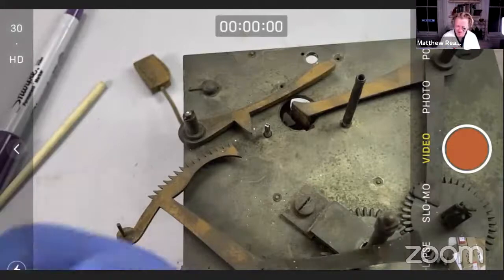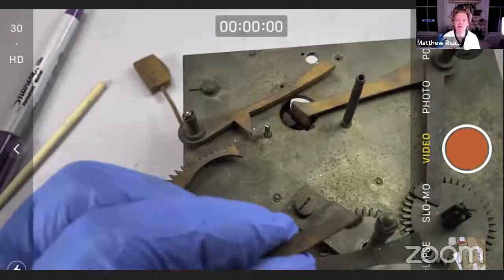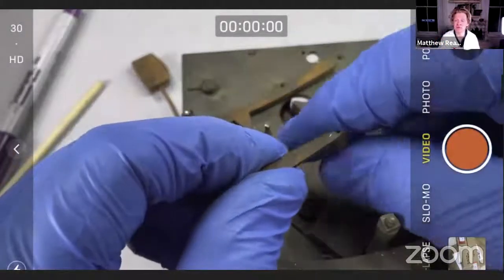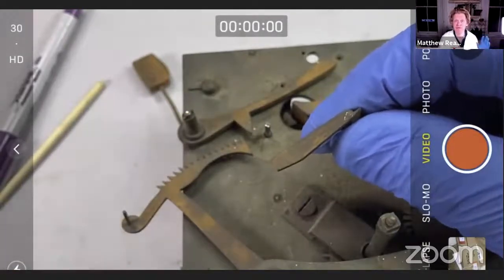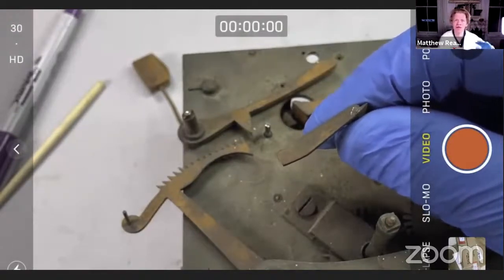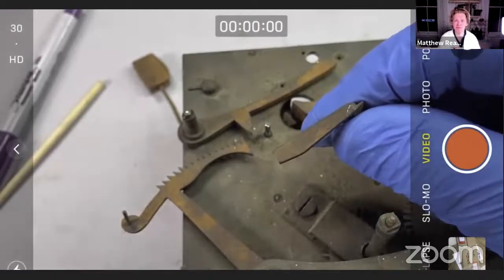No, it's soft solder. And the problem with that is that it's become loose on the square, and with a gathering pallet, or anything that fits on a square, if it's loose, it will just get worse and it'll get a lot worse quite quickly. So if you get something like that component and think, I might get away with it, you won't. It'll just cause a big problem. The minute it gets loose, it's problematic.